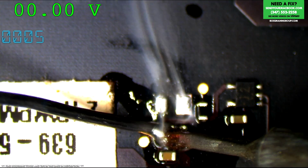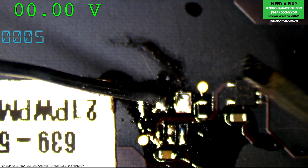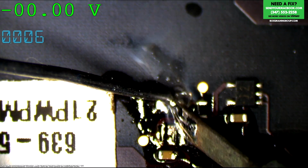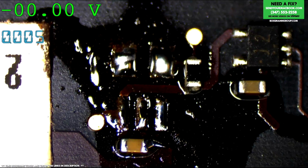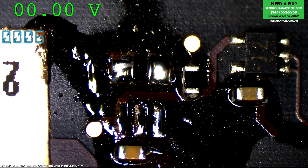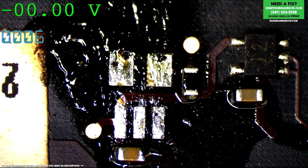I think I got an Apple junk board, Paul. Let's fix Apple's junk. What's the company that's doing Apple's refurbs? Is it Flextronics? And oh my god, did they really solder on top of corrosion? No. Oh, come on. This is the first thing I go over in every video. You scrape and file. I'm not saying that you have to put down new pads and go crazy with that, but if you see that something was minorly corroded, just use your wick and file a little bit.